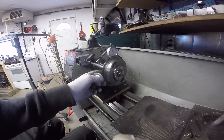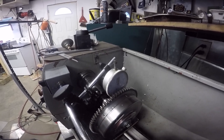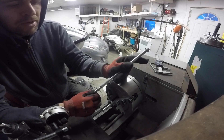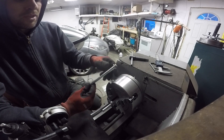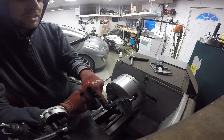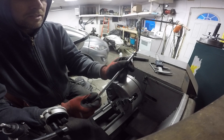So what I need to do is make a shaft that will be more flexible. In order to gain accuracy and make finer adjustments to balancing the flywheel, I need to modify this — but the basic proof of concept is a success. What I might do is cut this off, drill a hole, thread it, screw this in, and then while it's still in the lathe, turn down a bunch of this shaft so it's perfectly concentric, or maybe even grind it. Then I'll have quite a flexible shaft that is strong and plenty long.